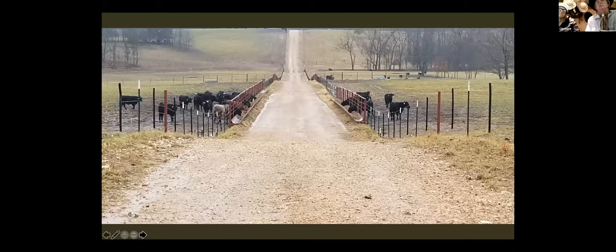This is a grass feedlot down in southwest Missouri. They tried the suspension fence and had really great success — that particular fence is 20 on center in a very high-pressure situation with lots of cattle in 10-acre lots feeding commodities. After doing that first fence using poly stays and suspension, they've literally done every project on all the ranches they own with that system. That's Jackie Moore Livestock out of Mount Vernon, near Joplin, Missouri, with the Joplin Regional Stockyards — they put these fences to the test.